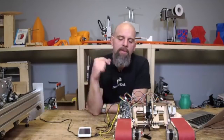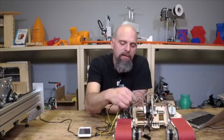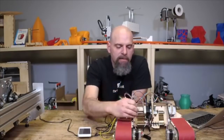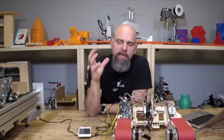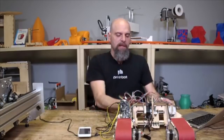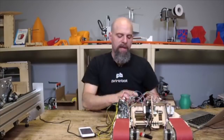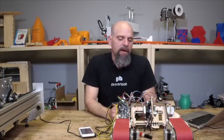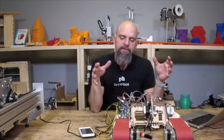And then I think even better would be a small version of this that is metal, because I could dump all of these and just go to linear rails. I've got some short linear rails that I'd love to use. That will dramatically reduce the visual impact of this, and metal can be very few pieces, yet even stronger, because this stuff does flex. I think you can see here, look, there's twist in the middle, but if you had aluminum plate on the back here, there'd be very little twist, depending on the size I use. So I'll get this done, get it in a printed model, make sure it works, and release those files. I'm not going to worry about it too much.